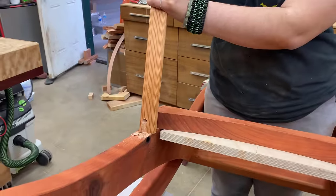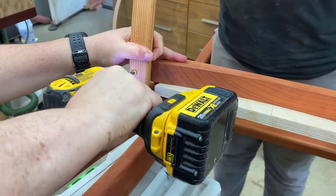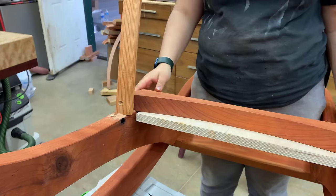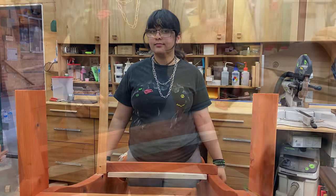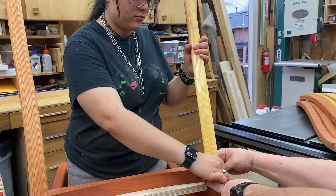And what I've done is I drilled it out with a countersink, and then I used a slightly bigger drill to drill just through the 2x piece of material itself, not into the backer, just to enlarge the hole a tiny bit so that I don't risk splitting it, because I'm really close to the edge of this backslat.